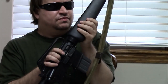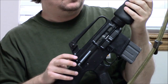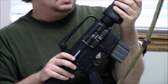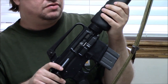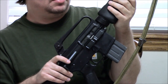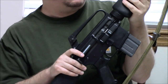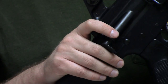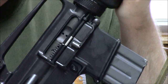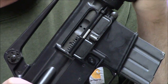They switched the buffer. Another change that happened is the military okayed the use of a Parkerized bolt carrier group in '65. So first the chrome bolt carrier disappeared, and then soon after the chromed bolt head disappeared and went to the modern Parkerized style. Also the split pin, the machined split pin, was replaced by a cotter pin, the one we know and love today, and the modern firing pin appeared. So the bolt group changed. Interestingly enough, the little cam pin never changed, much as it was Parkerized.